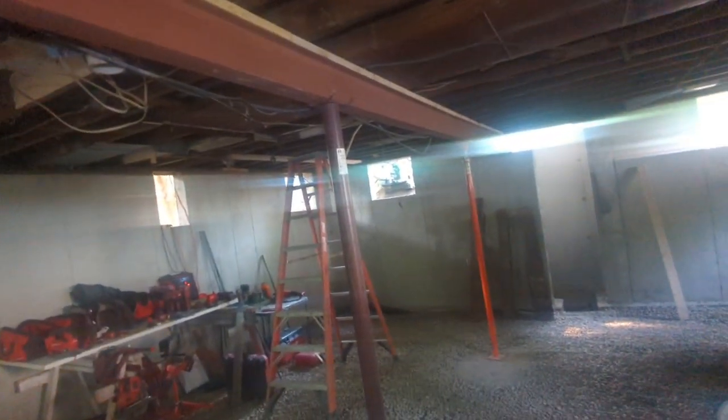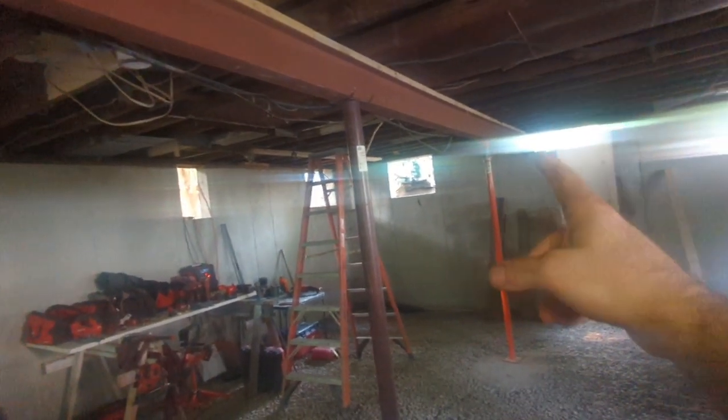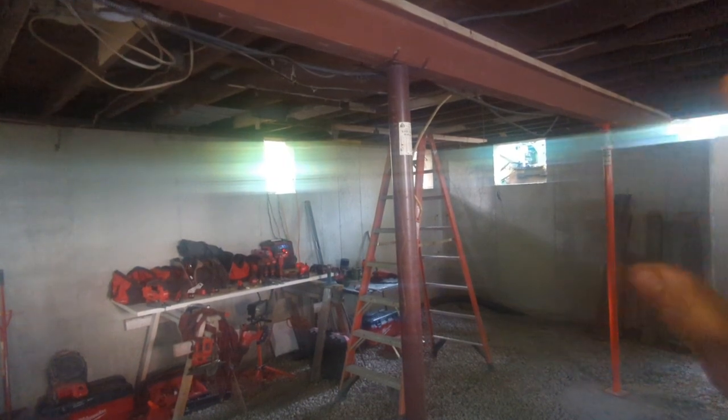Like if I came in here with some 2x10s, which I have laying around, 16 footers, and made a three layer beam from just inside the wall to just inside that wall, and went right on the pier 1, 2, 3 with my shores, and went up and took the weight off of this over here on this side, then I'm free to see if I can't get some help and slide it back out of here and have the steel guys bring me something taller by 3 inches,